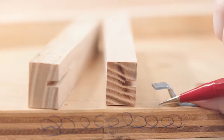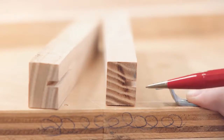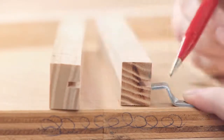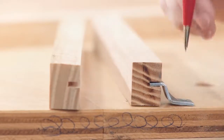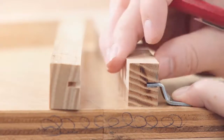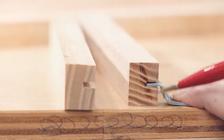So this is 3/8 of an inch. This may vary depending on manufacturer, but this is 3/8 of an inch from the bottom of here to the top surface here, and this is 7/16. So while it doesn't fit in, you have to lift this into place, and now you have a gap down here for the screw to pin everything down. That sounds like it's a good fit, but it's actually not, because the distance is not great enough.